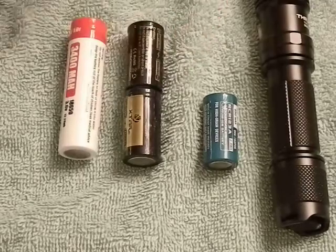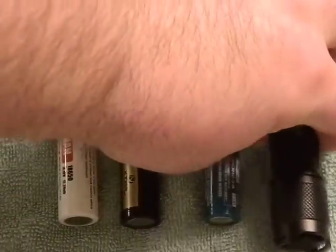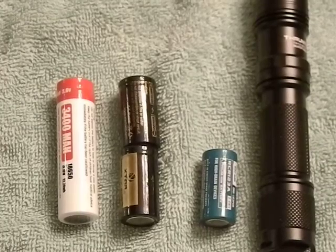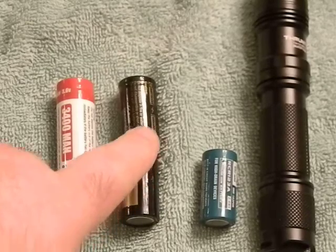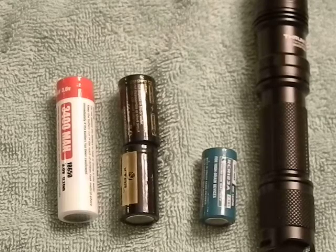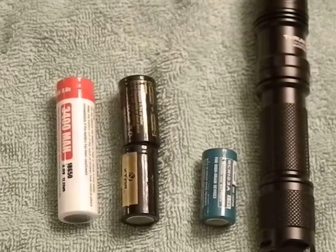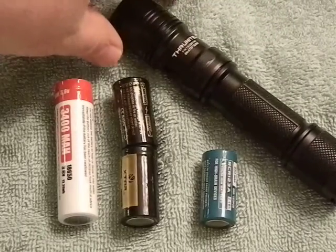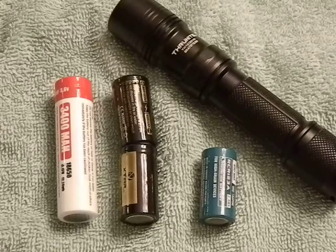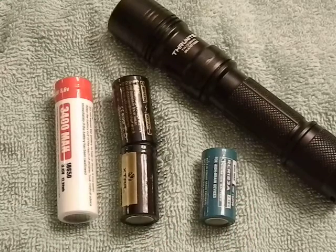These 18350s here are 850mAh apiece for a grand total of 1700mAh. You've effectively added a whole new option to your flashlight. You're still at 8.4 volts, so you get that brighter output, but comparing two RCR123s at 1300mAh to these at 1700mAh, that's an extra 400mAh. At full blast drawing around two amps, a flashlight like the TN12 will get an extra 10–15 minutes over the 16340s. In lower modes at around half an amp, you're adding quite an extended runtime.